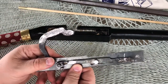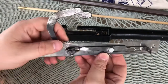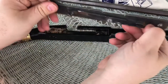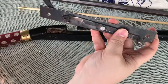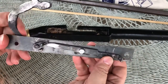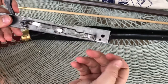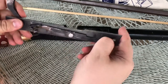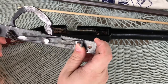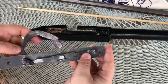Since this is the first one I built, I went through lots of variations of the parts and I wanted to be able to disassemble it as I was learning. It's just a bar with two little lips on either end, and it feeds up through the piece I manufactured underneath and catches. Right here there's a spring — I didn't follow historic methods on that part because it was a lot easier to just use a coil spring, which is cheap and easy to find. The coil spring pushes down on the trigger bar so it holds it in the open position, and when you push up on the trigger bar it catches and pushes that down.